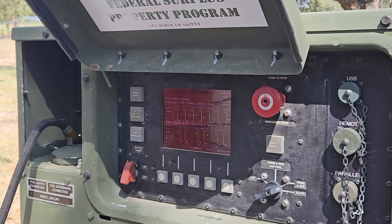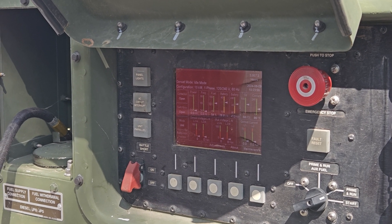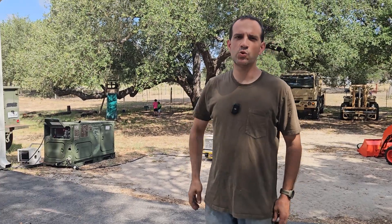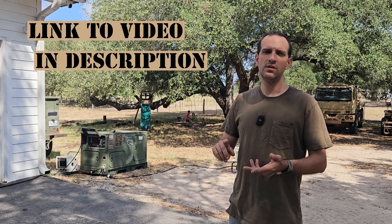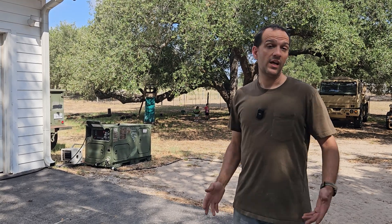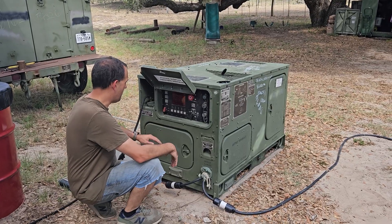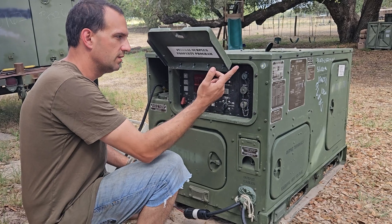This is ready to crank. Put it to prime, pumped the fuel, and it's going through its idle-up. I'm going to let it warm up a little bit. While it's going through idle-up I'll follow the same procedure I showed in my load banking video — six hours total, and once it's up to temperature I'll go through five-minute intervals stepping up the load. There's a link to that video in the description. I'm going to close the AC circuit — we're putting out power — then cycle up.